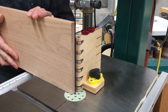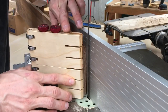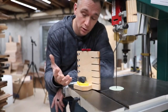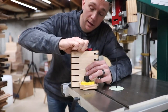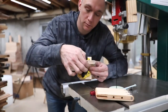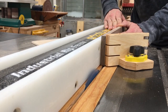Roller guide on one side, featherboard on the other. Much easier to build, very similar functionality. One nice thing about this design is that it allows you to take it apart so that you have a half-height unit. This wasn't possible with the other one because of all the hardware inside the body. You can use it on a table saw without all that extra height that's not doing you any good and is just getting in the way.